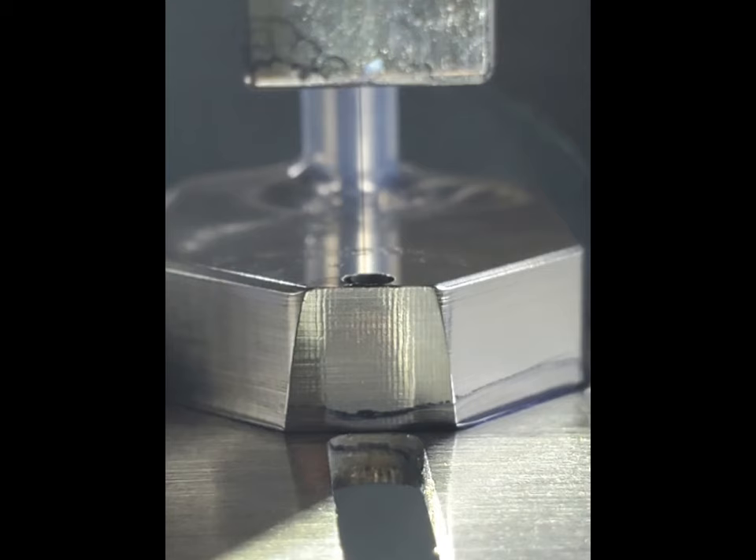Once we've done that, the jet is in the center of the hole down here, so we're going to turn it back through 90 degrees and put the knurl screw back in so it comes down and rests in there. If you're using the regular vise, you won't need to take this screw out — the only reason I'm taking it out is because it doesn't actually fit in the housing the other way around. Now we've adjusted the jet alignment vertically, so the jet alignment is in the center of the gutter hole.